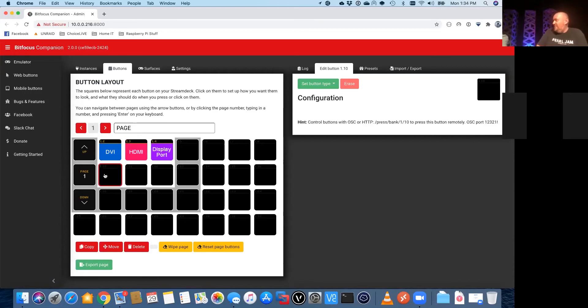In our demonstration here it's very simple — I have my laptop and the Nova Pro both plugged into a network switch. As long as your laptop and the Nova Pro or whatever processor you're using are on the same network, that's what matters. That's why when I started setting it up, it asked for the IP address. Any piece of gear you want to talk to has to be on an IP address that you can hit from this computer. Can you configure it to control two different pieces of gear on the same keypad? Oh absolutely — that's the beauty of it. You can have all sorts of different gear you're talking to, and you can set macros up too.